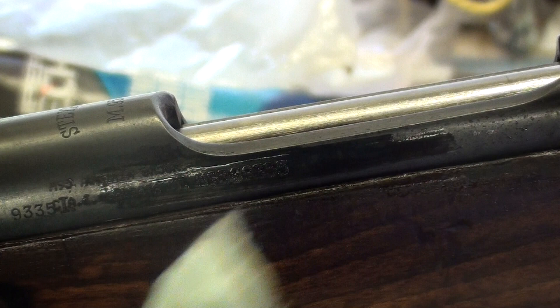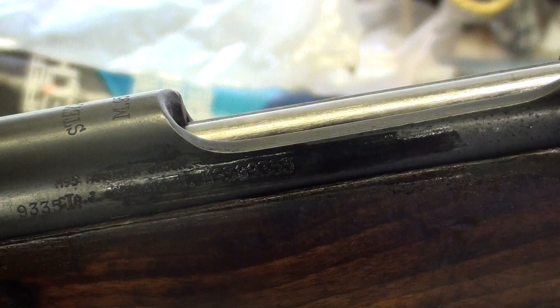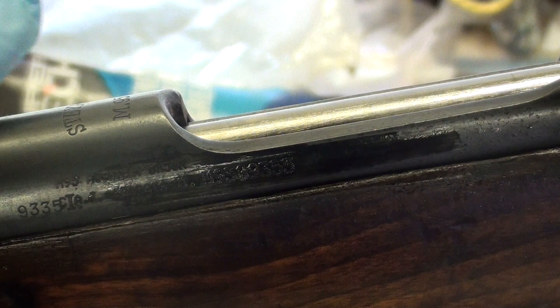I'm gonna let this sit about a minute. I'll leave this same cotton ball with the blue on it because we're gonna use it again. We're going to go about four or five coats to get it nice and dark, then sheen it over with just a little bit of steel wool, put a coat of oil on it, and this piece is good to go.